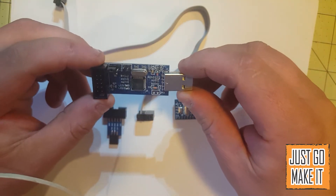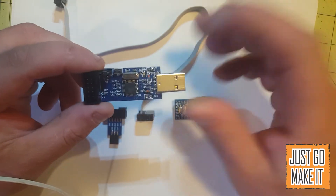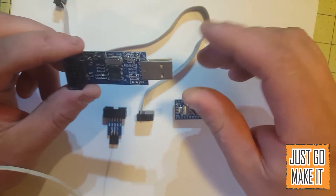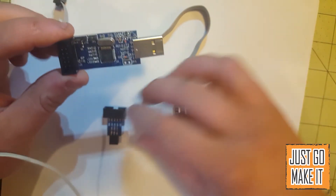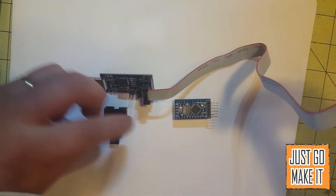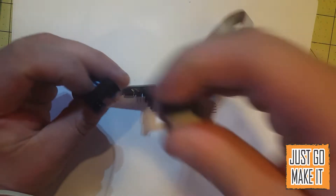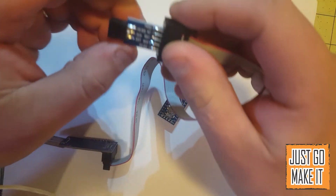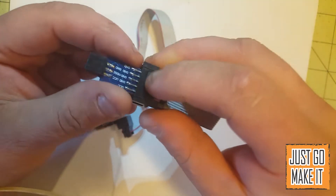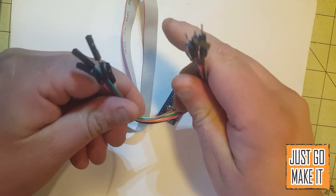The other thing you will need is a USB ASP programmer. These are a little USB programmer and you can program actually any of the Arduinos with one of these — they are really cheap. I will put a link in the description. With it you get a 10 pin connector, and most of them you also get a 10 pin to 6 pin adapter. The nice thing about these adapters is all the pins on them are labeled. You will also need six little breadboard male to female jumper wires.